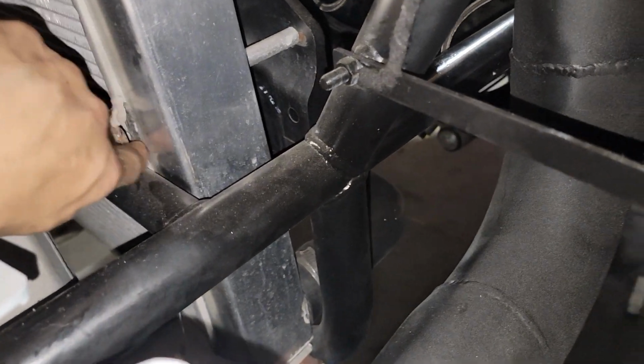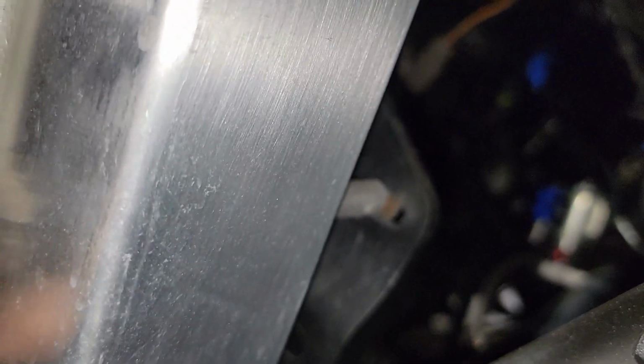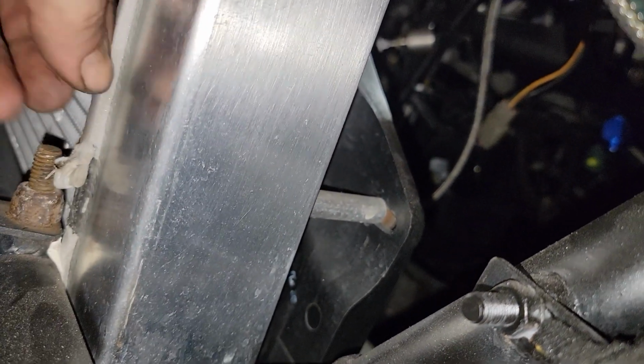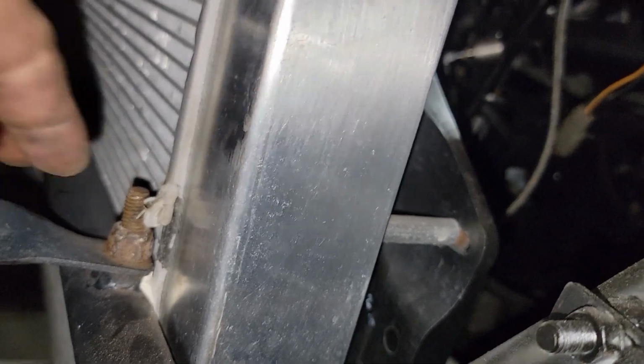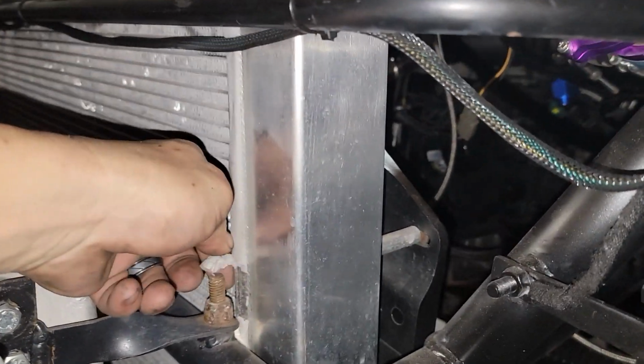This was actually, you can see it cut the little weather stripping. You could just about see in there, right in there, it's starting to hit the weld, because this tab was way over. So I ground the tab down, I put a tube over the bolt, bent the bolt back some, so now the intercooler comes off and on. When I took it off, the nut kept hitting.